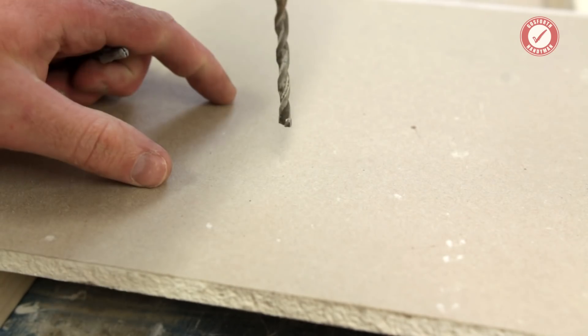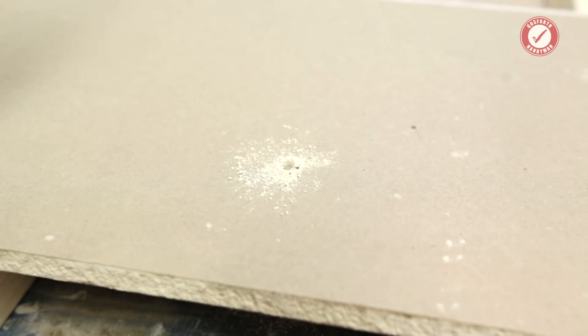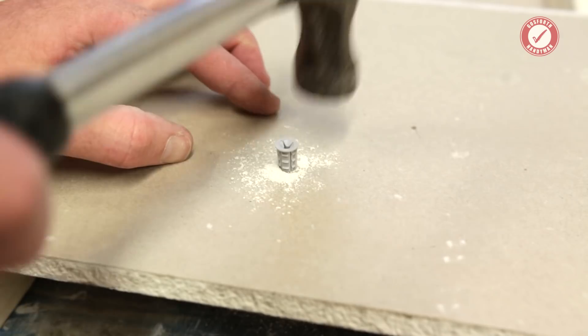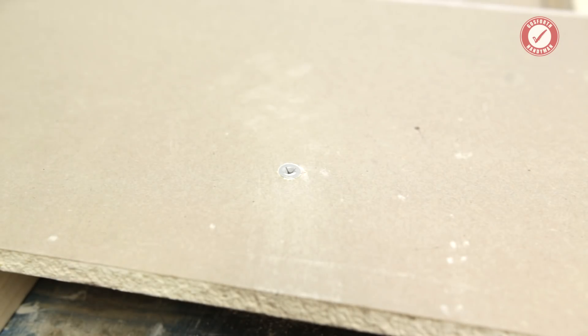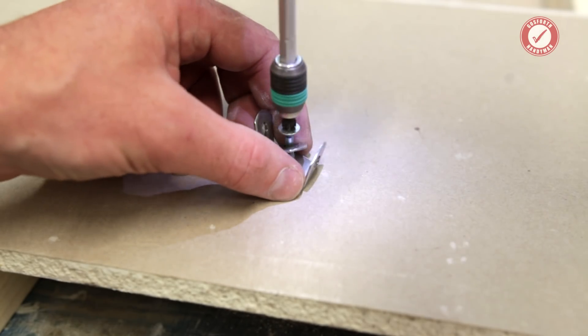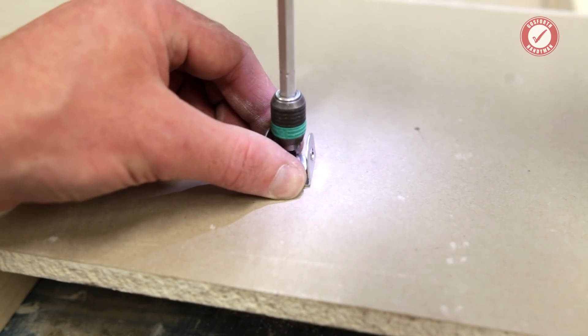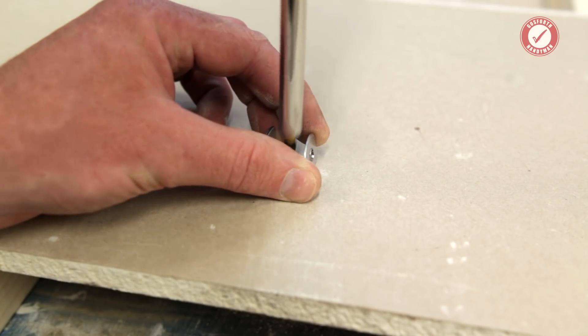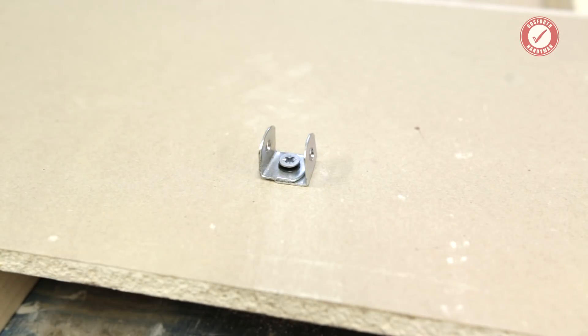The way I like to fit these — I'll use a 6mm drill bit. I always use a masonry bit into plasterboard and then just tap it in. That's ready to rock. I'm going to go with a 10 gauge screw and pop a washer on this screw as well.